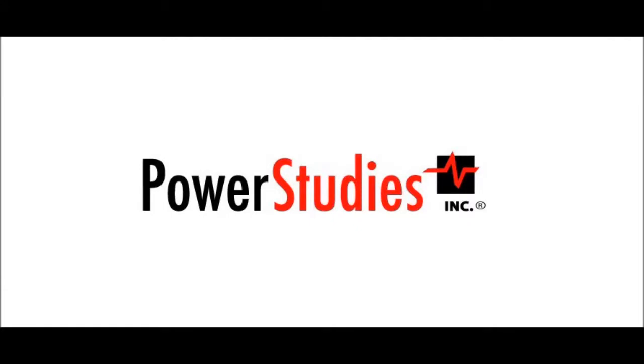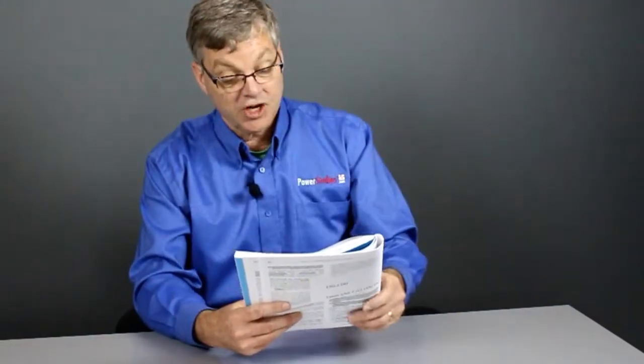Well, thank you very much for explaining that, Bob. So there you have it — that's when you need an Energized Electrical Work Permit, and that's when you don't. Wait, there are two more things: access to or egress from an area with energized electrical equipment if no electrical work is performed and the restricted approach boundary is not crossed; and general housekeeping and miscellaneous non-electrical tasks if the restricted approach boundary is not crossed. So there you have it — four different exemptions when you don't need an electrical work permit.